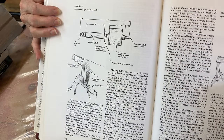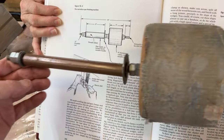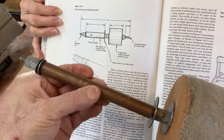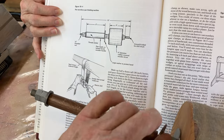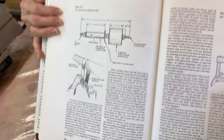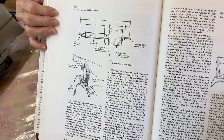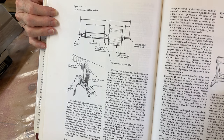Last time I didn't really show a drawing of the tool that we used for sanding — this is it here. All this is is a piece of pipe on some threaded rod, nuts locked together, washers locked together, more washers, a wooden block, and a drill. That's how Bud drew it — well, Sam Manning actually drew it — but that's the one that Bud Macintosh liked and used.